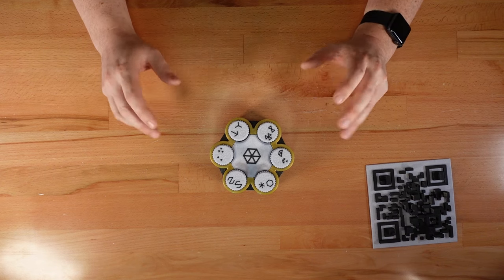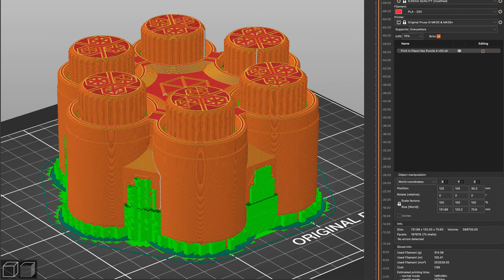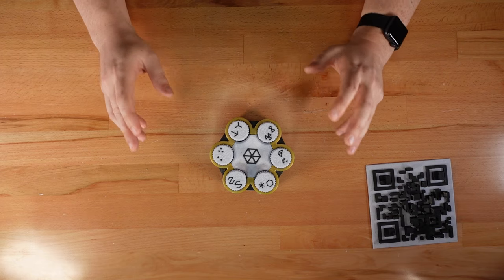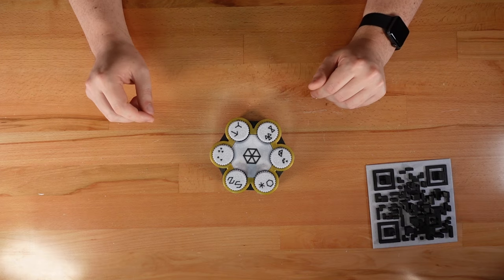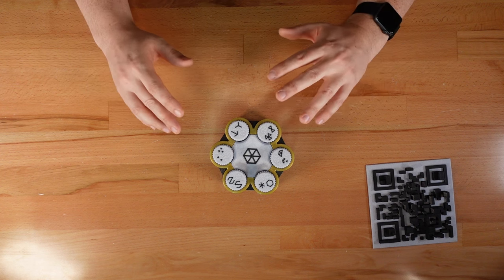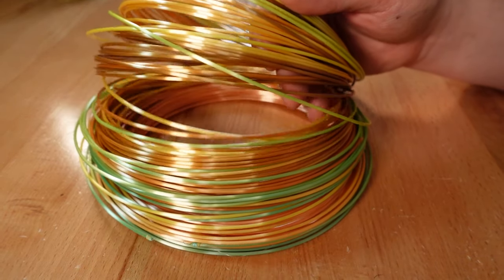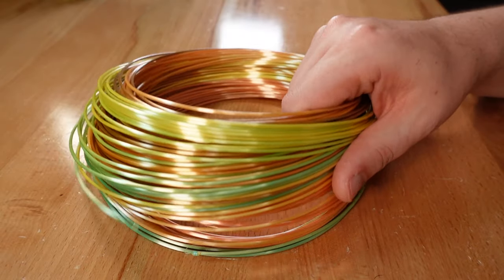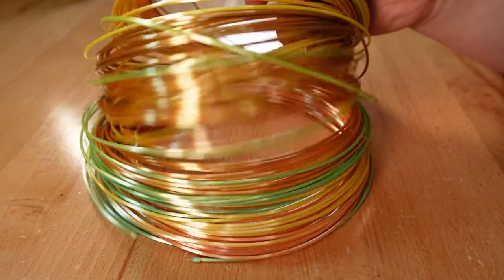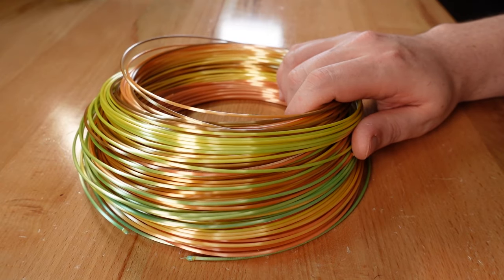Here's what you need to know to get a good print. Don't add supports or brims. They'll just clog up the puzzle mechanism. You'll need a well-tuned printer that produces consistent surfaces, can easily print 0.4mm clearances, and won't string. Avoid the more brittle types of PLA filament, like silks, wooden fill, or matte formulations. These can look nice, but they're less reliable on mechanical prints.